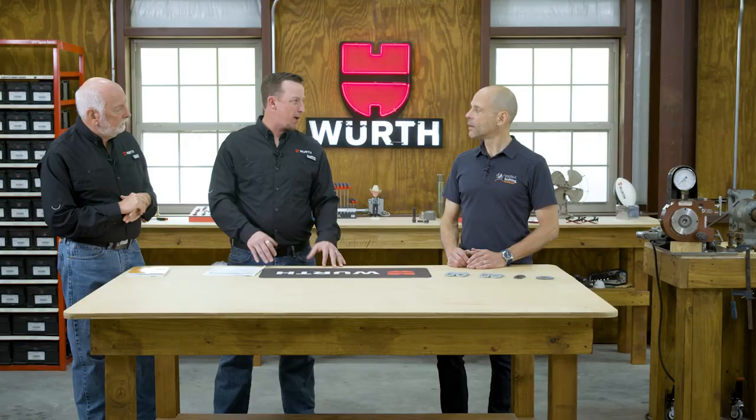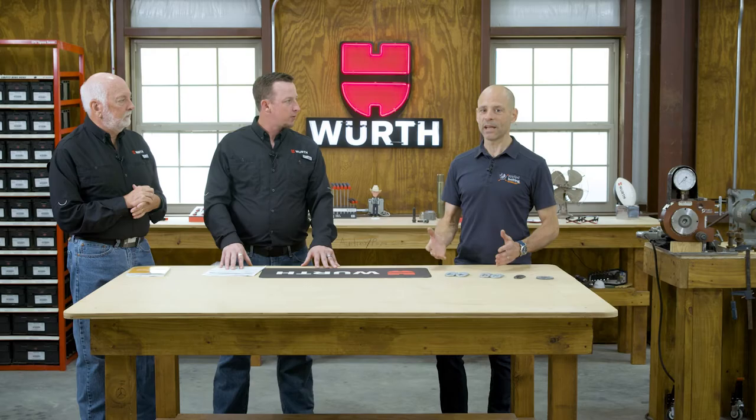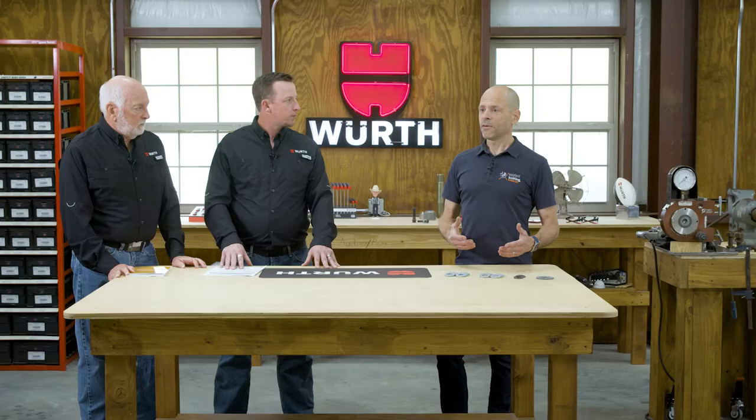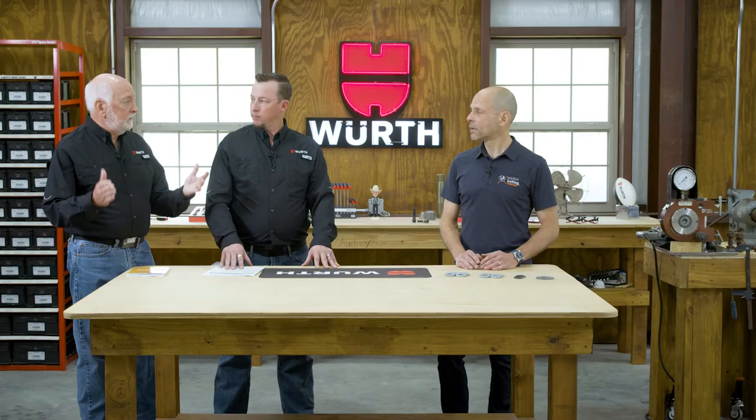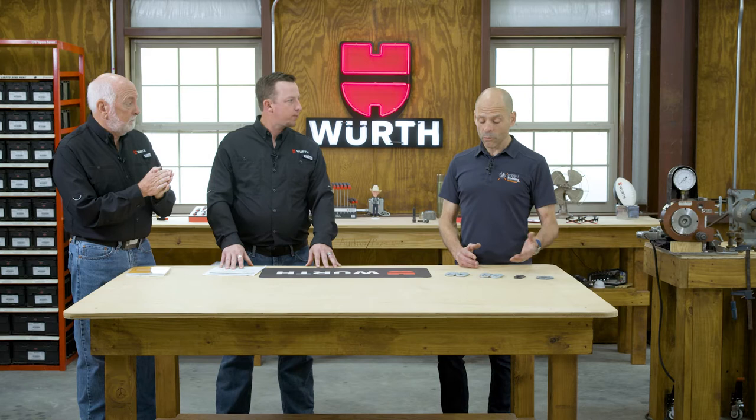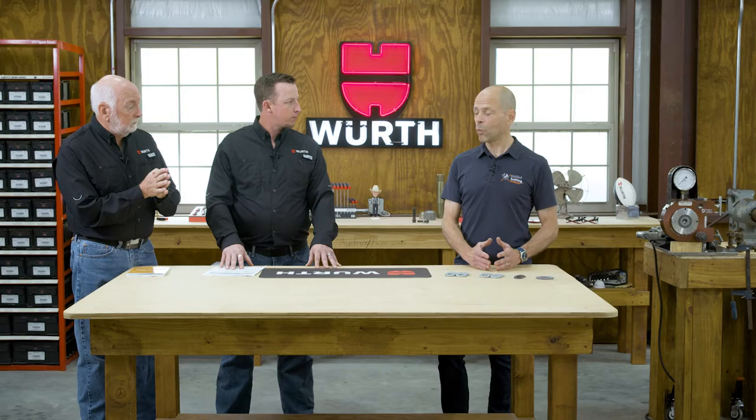What sizes are we talking about? RCSC covers half inch through inch and a half on installation. ASTM also covers half inch through inch and a half. We do have special requests for 449 and 354 bolts that are bigger in diameter — beyond inch and a half — for wind towers and some specialty construction items. And that's based on the customer giving us the compression load they're looking for. When we go beyond ASTM F959, we have to have the engineer tell us what tension they want.